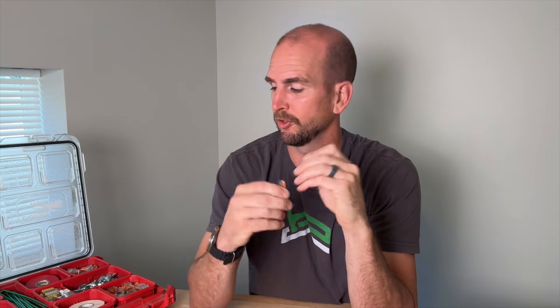To be honest, I do think it's a bit crazy that that's approved to be buried in the wall, and I definitely don't love the fork design, which you see in the manufactured home industry — that's really where that splice came from. An option that came out from WAGO since then is the WAGO 221 inline splice, or the 2401. This would be for one conductor going in one side, passing through the inline splice. This would still need to be in a junction box, but it's in my standard kit and is my preferred method.